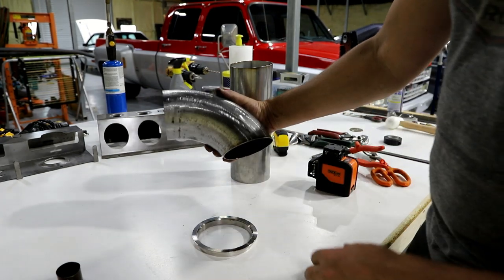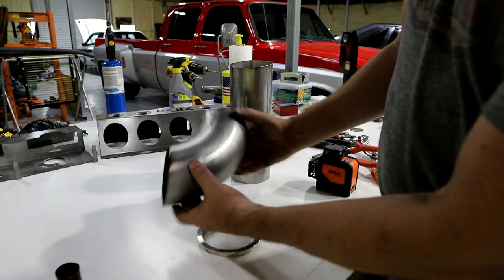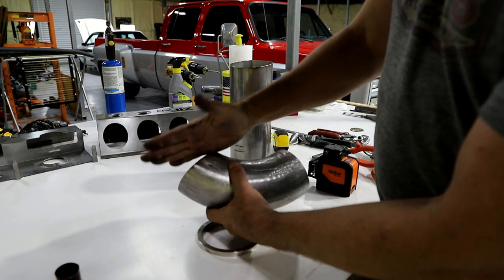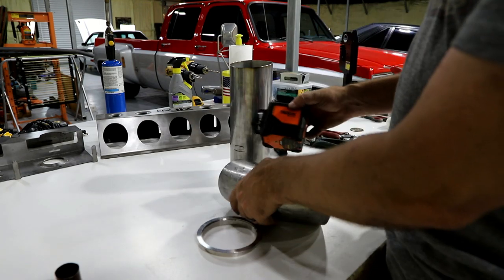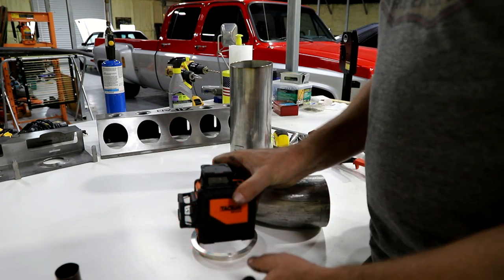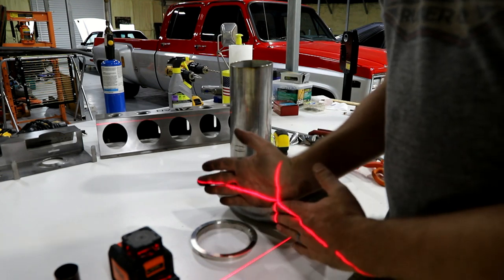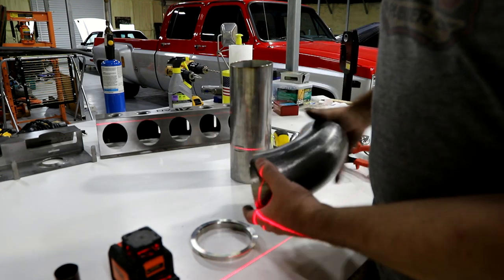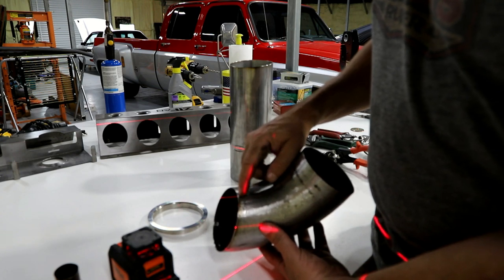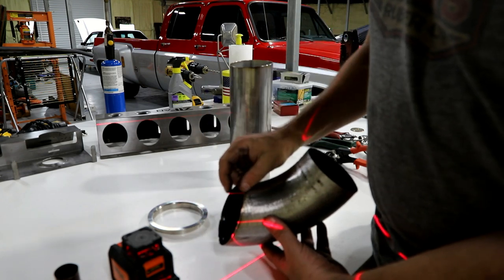But if you look at this, I've kind of baloney-cut this — so it's not a perfect 90 within this tube itself, it's kind of baloney cut. I'm just kind of cheating the bend a little bit. And sometimes it's hard to get a flat cut all the way around when you're doing this, when you're kind of baloney cutting this thing. So what I like to do is use one of these — this is just a laser level. You flip it on and it's going to shoot a laser vertical and horizontal. This one's got a crossing point on it. So what I like to do is just figure out on the inside how much I need to take off — in this particular instance it was like an inch.